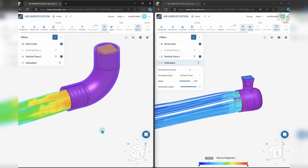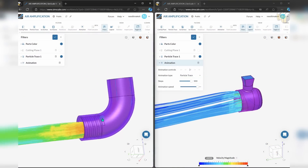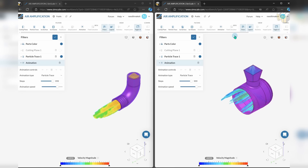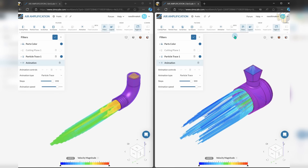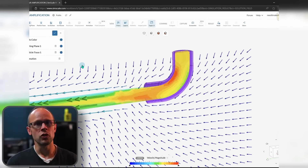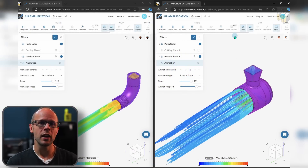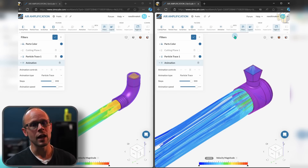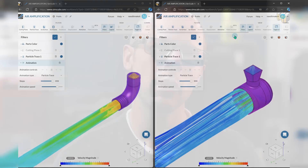I've also created a simple duct with just an opening and some interior corrugations, like the supply pipe. Looking at the simulation, we can see the higher-speed cylinder of air coming out, which then slows very gradually. It is pulling in a little air from behind but also entraining quite a bit out in front. Comparing to the amplification method, we have high-velocity air only until the very edge of the front of the duct — after that it slows dramatically. This approach is not really intended to retain a high-velocity tight cone shape; it's more about the overall volume of air being moved.